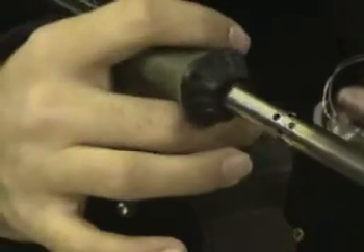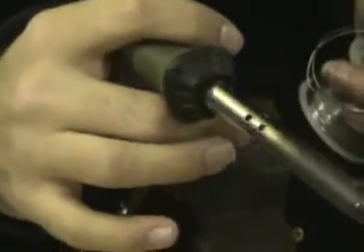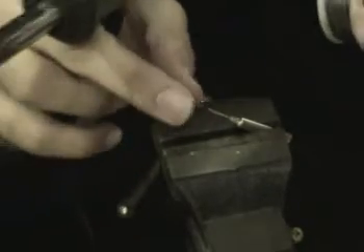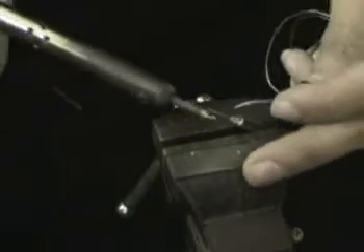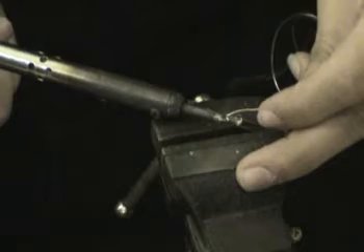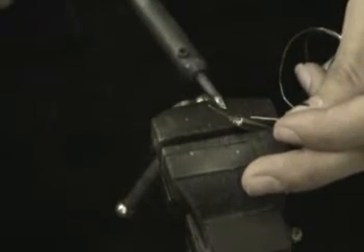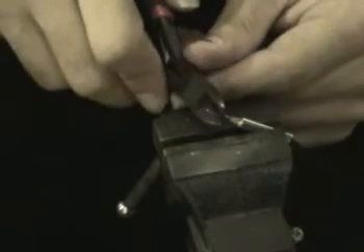I'm going to let this cool down a little bit before we go to the next stage. And of course, as always, pre-tin. Pre-tin. To tell you the truth, we don't even need to really do anything. As long as this little wire — the signal wire — is 2.5 centimeters, we really don't even have to do anything. But I want a slightly more sturdy wire than this really flimsy coax. I'm going to trim this down — that's an excessive amount.